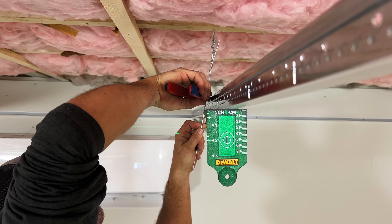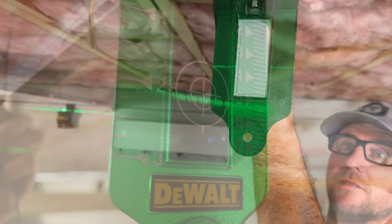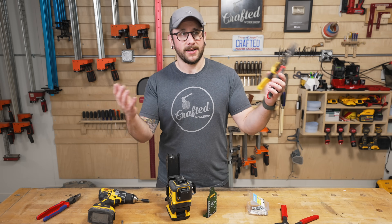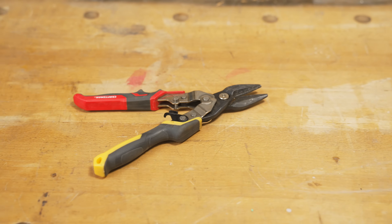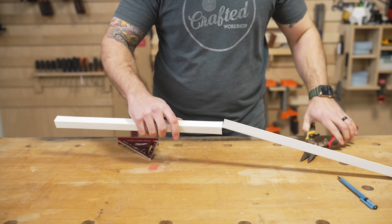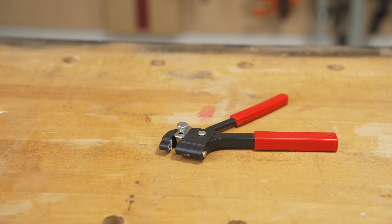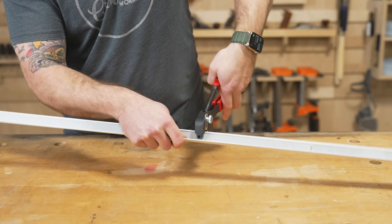This particular laser also came with a reader which was incredibly handy — it has a magnetic base so you could stick it to the main beam pieces. Even if you have a less expensive laser, you can buy these laser readers aftermarket for about five or ten bucks on Amazon. Another tool that's used a lot is a good pair of snips — you'll use these to cut wall molding to length, bend it around corners, cut your main beam and cross T's to length. Another specialized drop ceiling tool is this metal punch, which can punch holes in all of the various metal components to pre-punch holes in the wall molding.